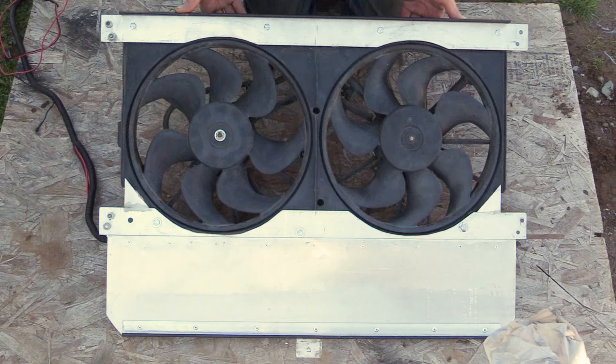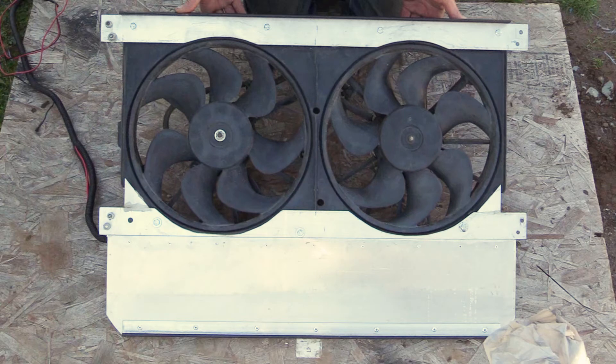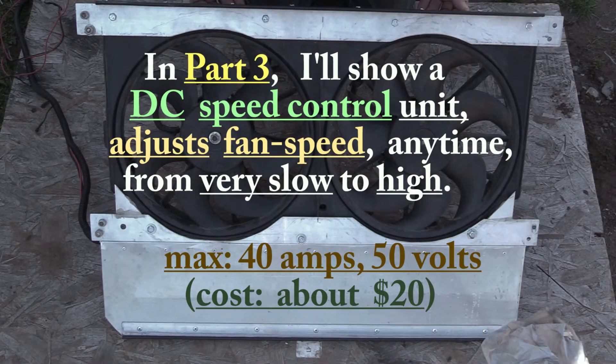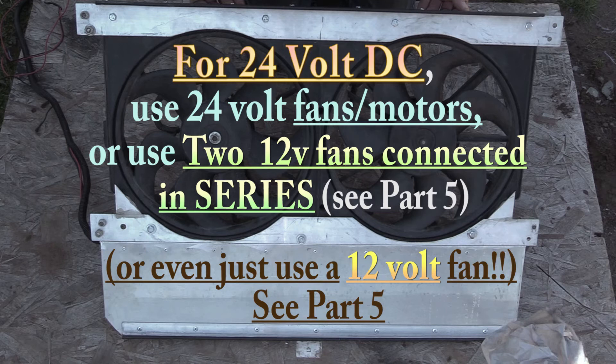I've got to come up with a new DC fan and pump that uses way less power but still gets the job done. For the fan, I've decided on car electric radiator fans. Most of them are good candidates, but some of them can be way too fast and noisy at full speed. At slower speeds they're better. I'll show you a DC speed control unit that will adjust the fan speed from very slow to high and everything in between. For 24 volt systems, I could just use 24 volt fans or use two 12 volt fans connected together in series. 24 volt fans are harder to find, but they're out there.